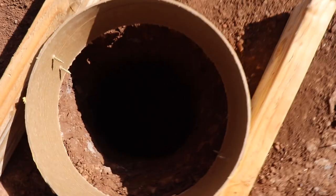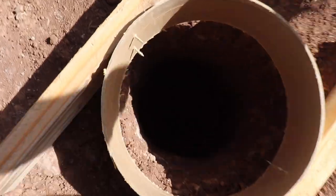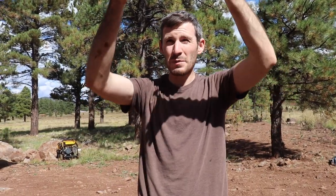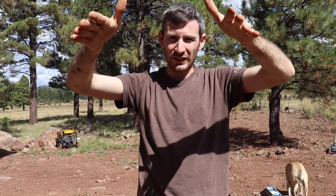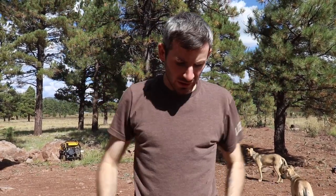So what we'll do is we'll put two pieces of rebar in here and then we have a little circular one that will go at the bottom. This one over here, we were able to do the full 30 inches down. As you can see, it's a little deeper. And then this one, we'll do the same thing. We have a little circular one at the bottom, and then we have our two pieces of rebar that will go right in there. Since we were able to do this one full depth, it's a 12-inch wide column all the way down, and then at the bottom, about 4 inches, it flares out and goes to about an 18-inch to 20-inch wide circle. So that way we have a bigger base, and then we go up to our column.